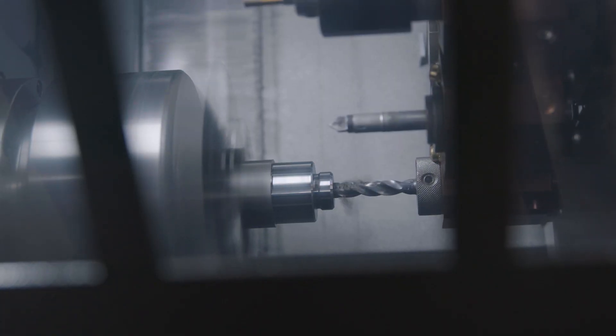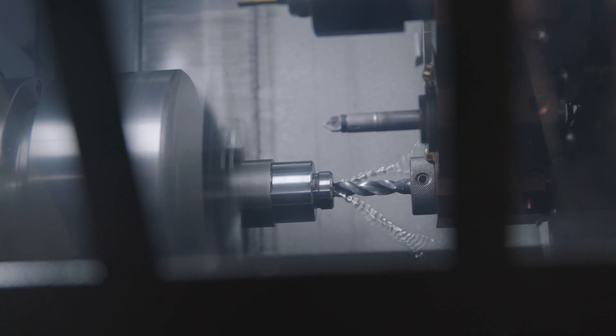With my technical knowledge, the lathe here — what is it, what does it do, and what specifications? The TM6 is our smallest lathe in our range of two-axis lathes. You're looking at a 6,000 RPM spindle, 12-station turret, could be VDI or slotted disc. You're looking at X176 and Z356 travels — just a nice compact machine.